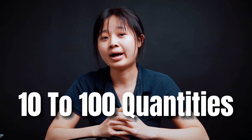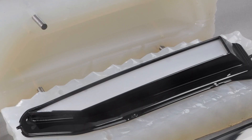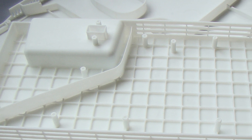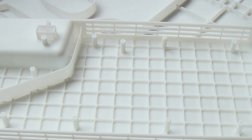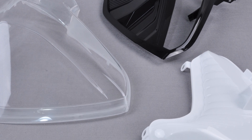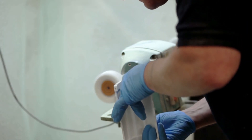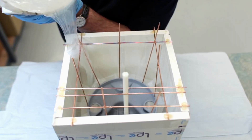If the required quantity is 10 to 100, then vacuum casting would be a good option. Vacuum casting can be used to closely simulate the final mold parts of finished products, which is a faster, economical way for creating transparent plastic prototypes in small quantities. For clear parts, we use PMMA material to make the CNC-machined master to get an impeccable surface finish, and then create the silicone mold.